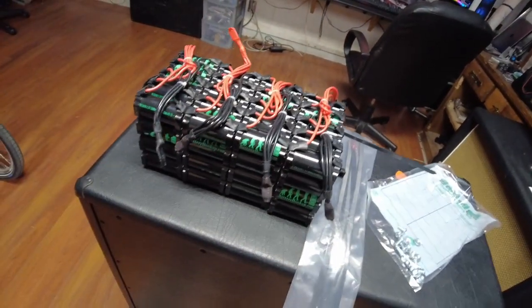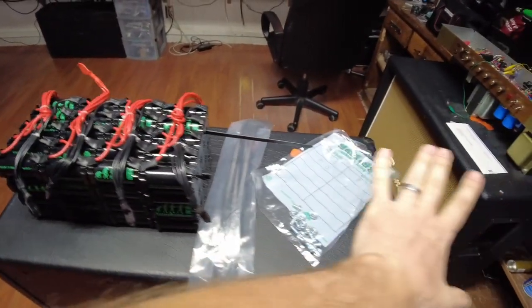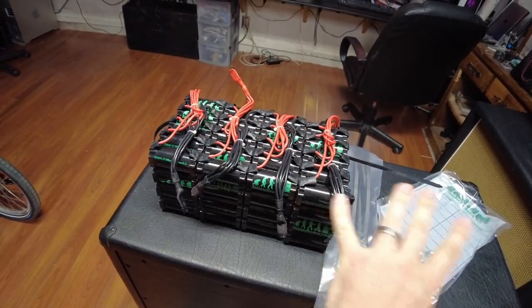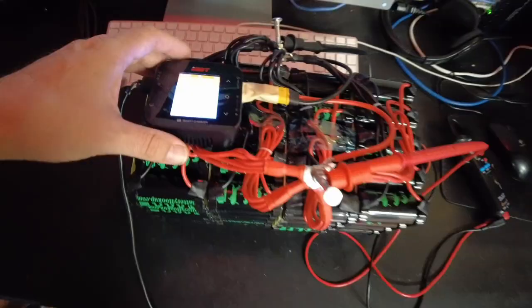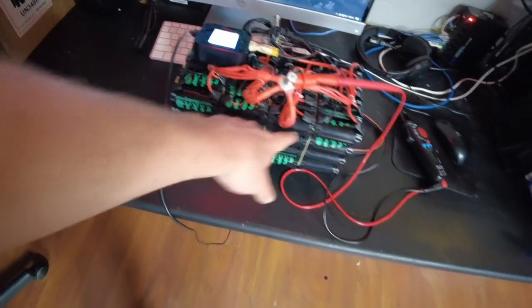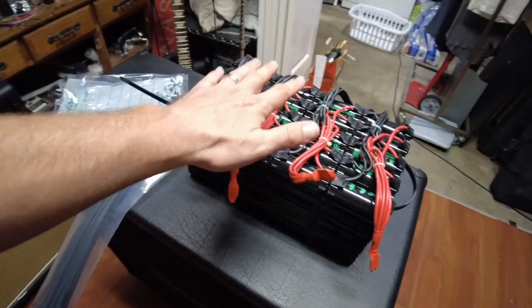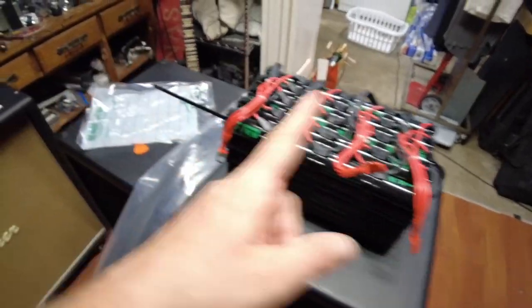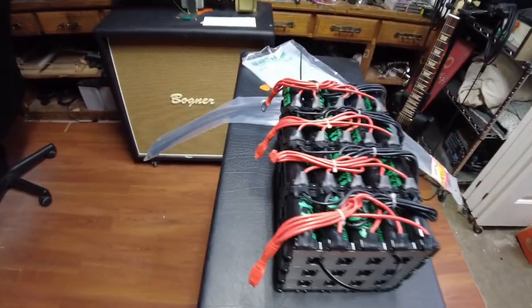This is as simple as it gets and it's super cost-effective. I actually got eight of these because all my systems are 24 volt. I'm going to put eight of them in series for a 24 volt battery. I've got four of them over here that are top balancing — charging at 10 amps, which is taking a while because right now these are four in parallel, so that's a 400 amp hour 3.2 volt battery. I'll top balance these four the same way, then put them in series and make a 24 volt 100 amp hour battery on the cheap.